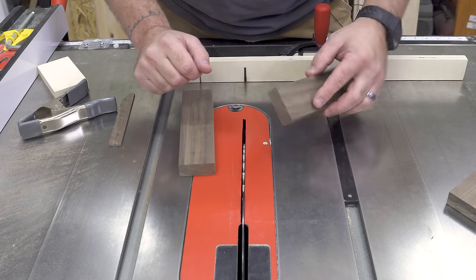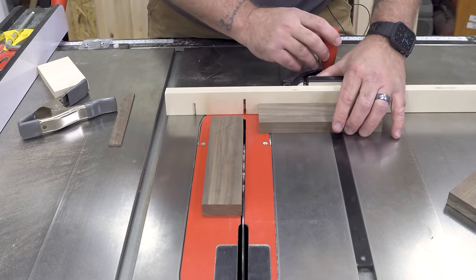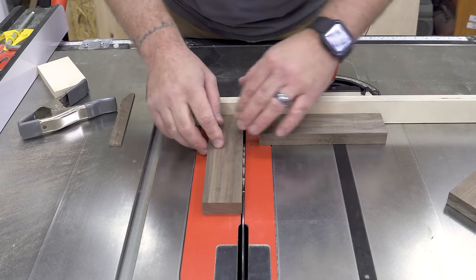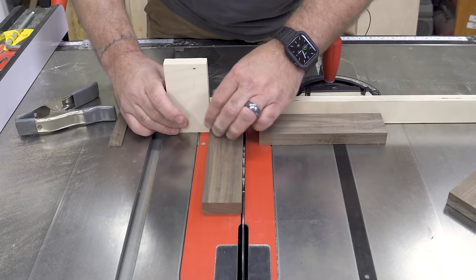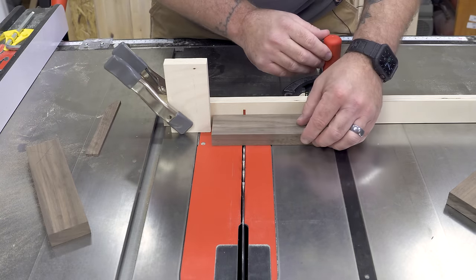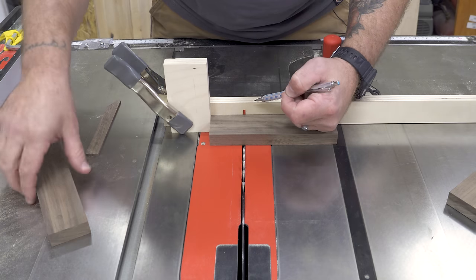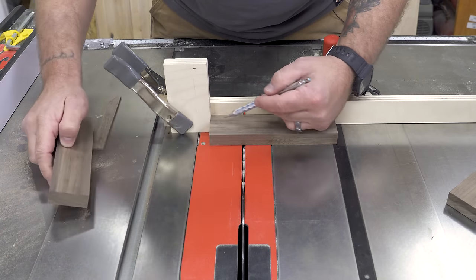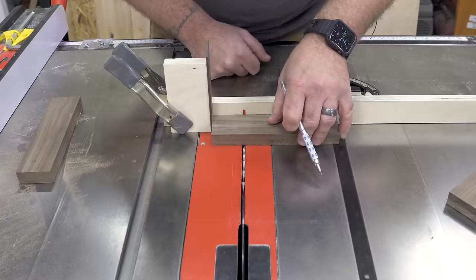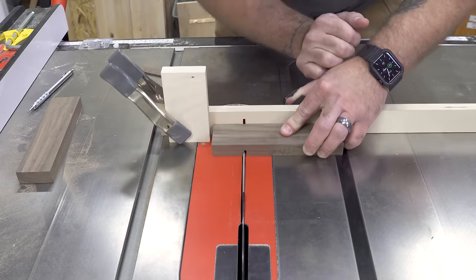We need to pay attention to where we're going to cut. I'm going to take this piece and slide it right up against the side of my saw blade, run it straight back, then take my stop block, put my clamp on it, and now I'm ready to cut. However, I want to show you something — if I slide this all the way over and cut, you can see where the saw kerf is going to land. That means I'm going to end up cutting too much material off and this will be too long. That's where this shim comes into play. If I drop that shim in there, make one cut, then take the shim out and clean up all the waste, I can do that to both pieces and they'll fit together perfectly.